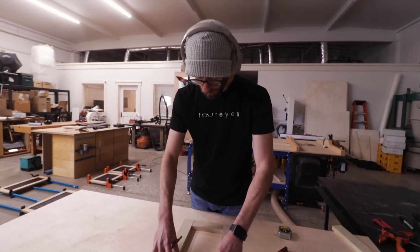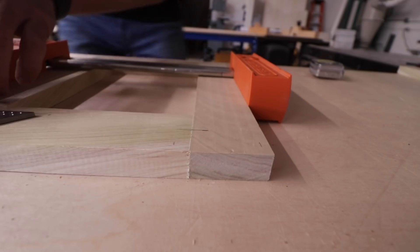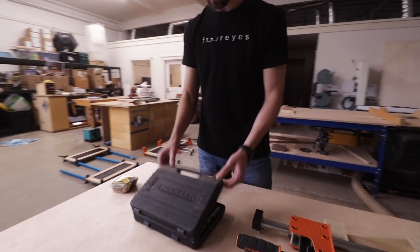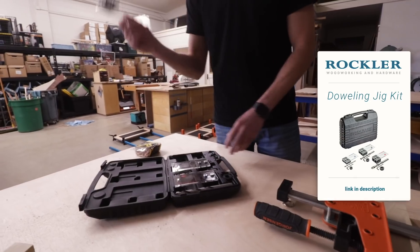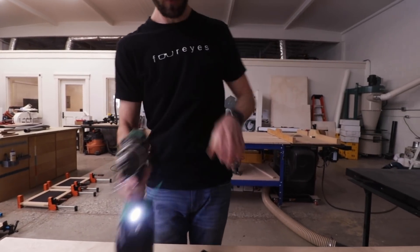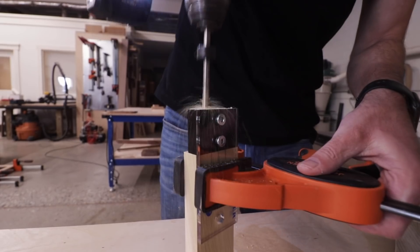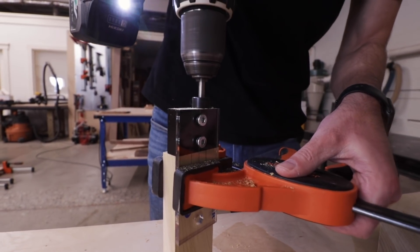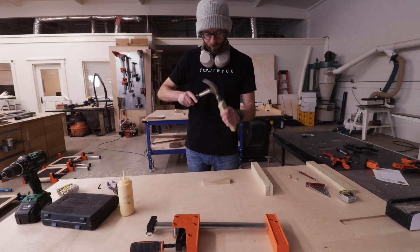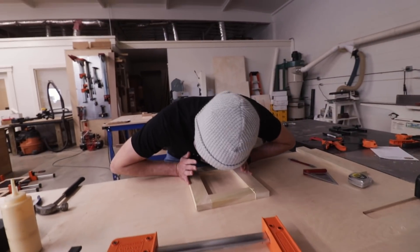To join them, we'll use our quarter inch dowels from the Home Depot. I got this doweling jig which can do quarter inchers. Just line that up with my mark. Almost like a cabinet door frame - yeah, it does kind of look like that. Let's get those.